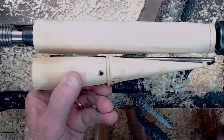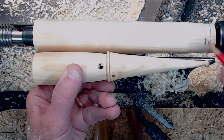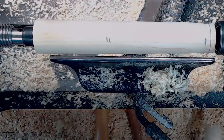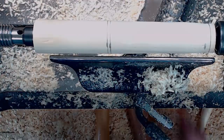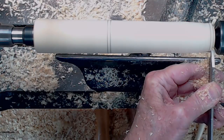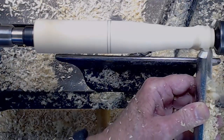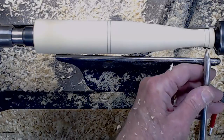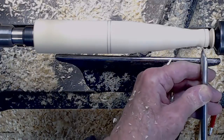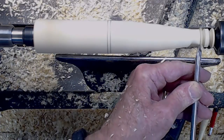Here's the model that we're using. This is about five to eight inches long. We mark off just a quarter of an inch on the end where it's going to be waste — where the tailstock live center has actually penetrated. So we mark the main features with the pencil. Start taking it down a little bit so we can guide our eye. Now we do some bulk removal. Notice how you can roll over the spindle roughing gouge if it's shaped straight across. I'm going to use a skew to make a V-cut, which to me is the easiest way to start a bead — make a V-cut with a skew on each side. That's way too big, but just marking the features right here.